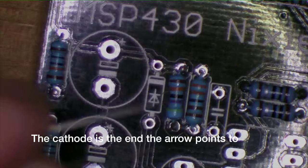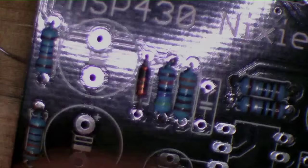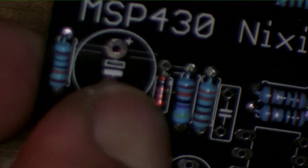Now, how are you going to know which end is which? Diodes do have an end — this black line on this side is the cathode. So I'm going to bend that lead and match the stripe on the diode up with the stripe marking on the board. I'm lining up the stripe right there with the stripe on the board and hoping I've done the right thing. When I look at the picture that Rob sent, it sure looks the same.